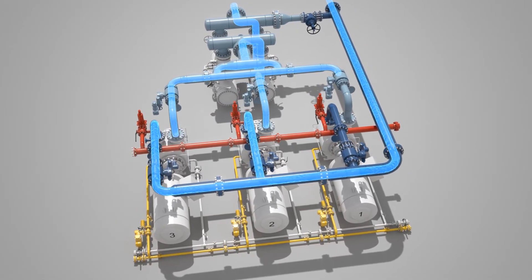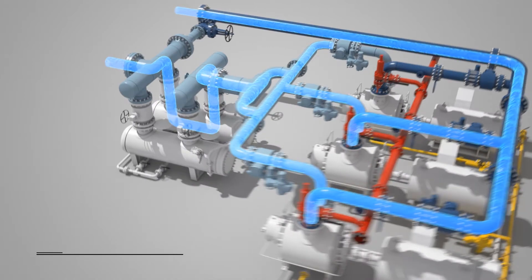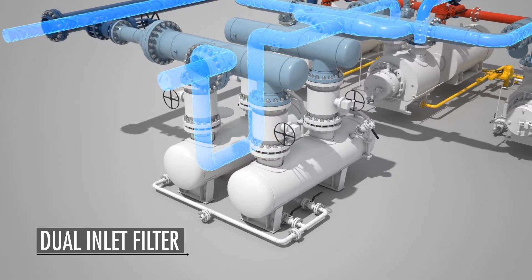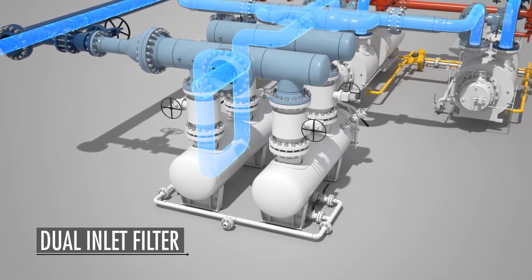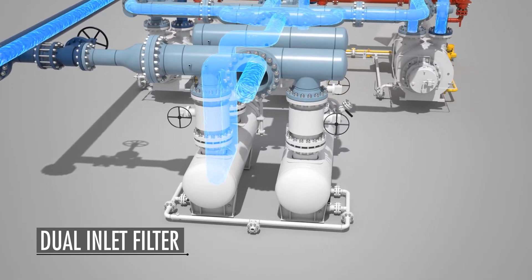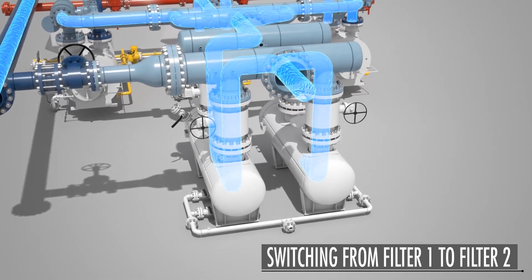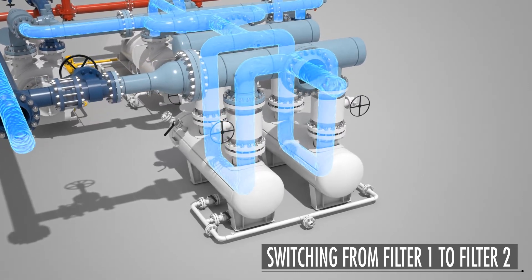One additional feature of Surcore multi-phase systems is that we incorporate dual inlet strainers. In order to provide continuous uninterrupted service, we recommend installing two strainers on all multiple pump systems, with one serving as the primary and the other as the secondary strainer. The strainers are fitted with differential pressure transmitters. When the differential pressure in the operating strainer reaches a preset point, an alarm signal is issued indicating that it's time to switch filters. Once authorization to switch filters is given by the operator, the valves to the secondary strainer are opened and when full flow through the secondary strainer is established, the valves for the primary strainer are closed, thus allowing it to be blocked in and serviced.